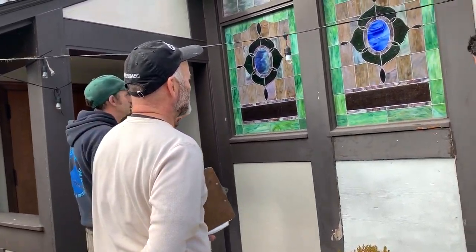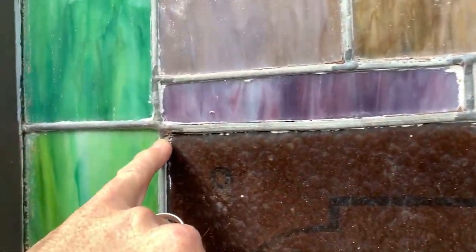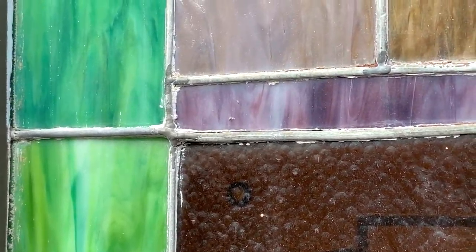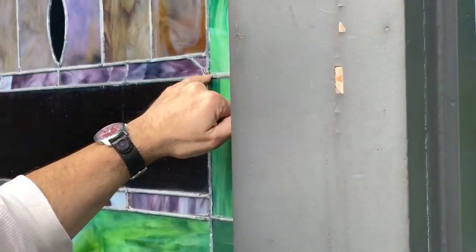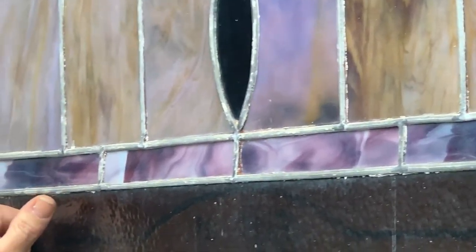There are spotty repairs, shattered pieces, broken solder joints through metal fatigue in some of these places near the solder joints. Some of the oxidation you see is from corrosion in the solder from the original flux, which is not agreeing with the metal.